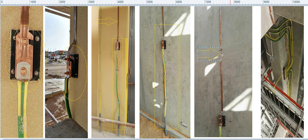Running at approximately 30 meter intervals based on the lightning protection layout design, these down comers are connected between the underground grid and the horizontal air termination above the building or structure for lightning protection. In the next slide I will show the air terminations.